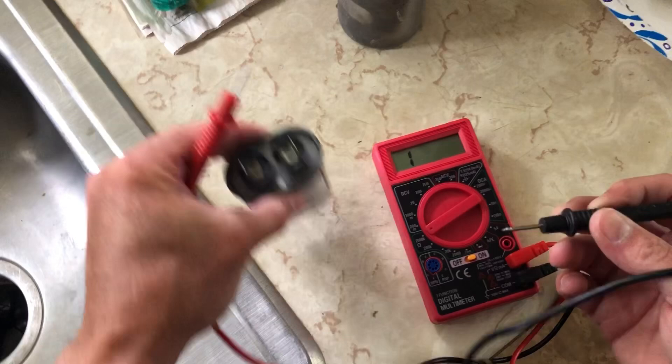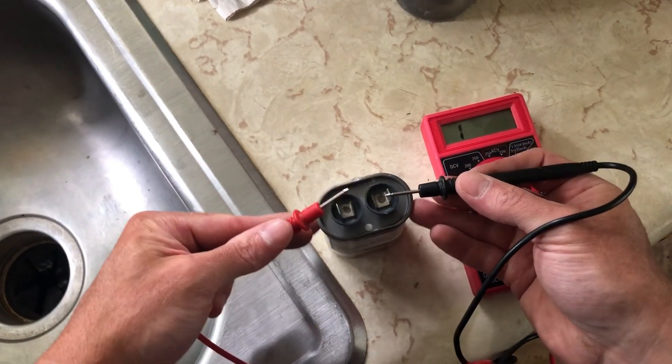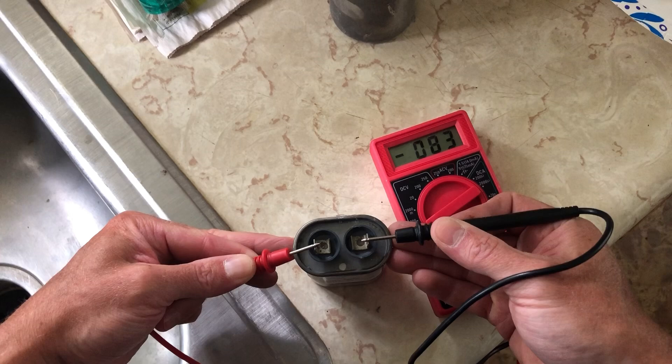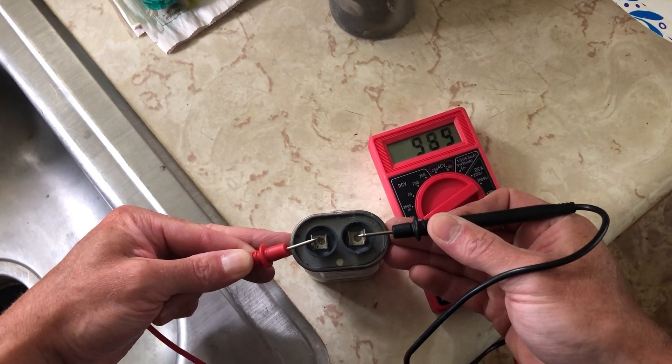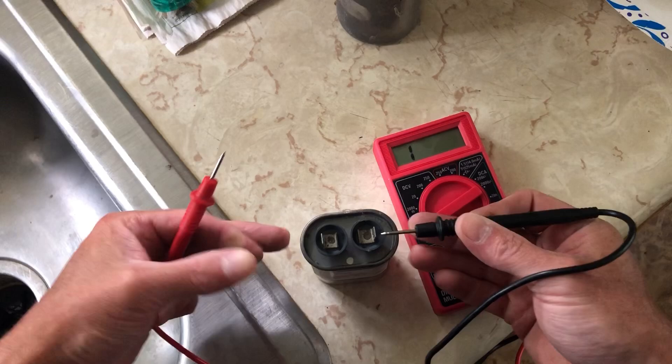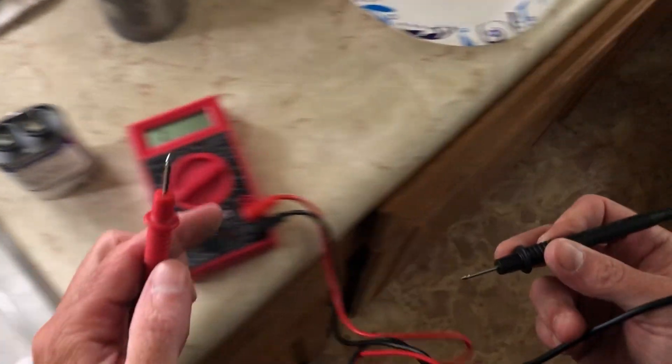You want to see a steady and gradual increase in resistance until there's an open connection. We'll touch the black first, red second, and you'll see it slowly climb up in numbers until it reads open — which means this is a properly functioning capacitor and it's working.